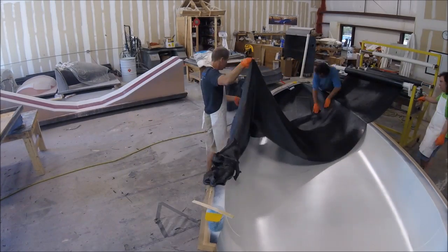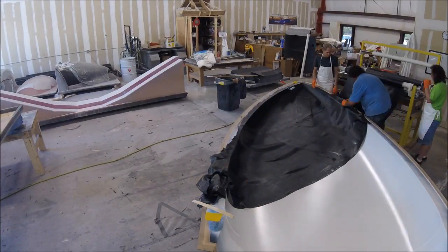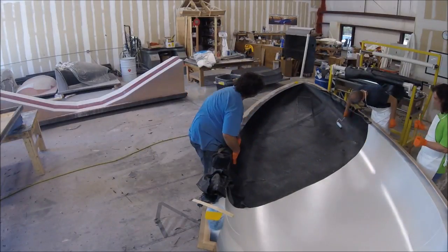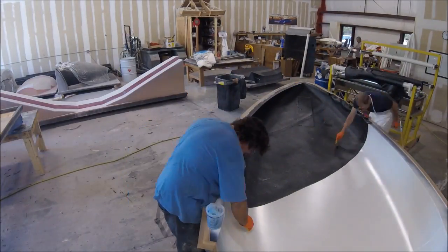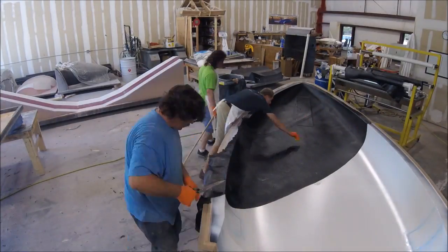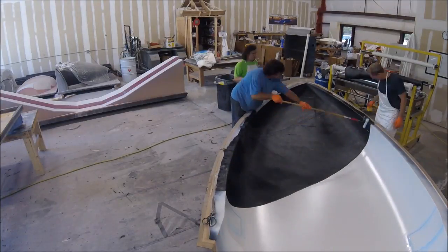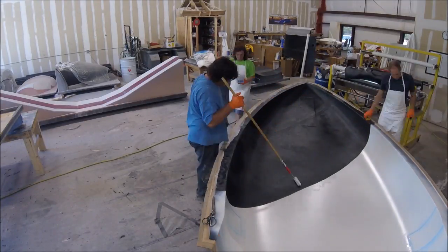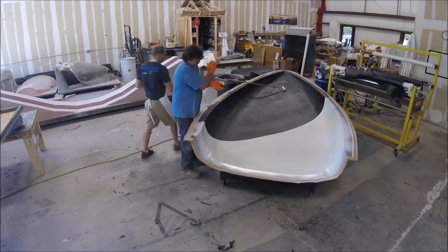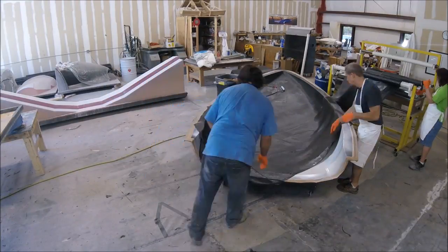Here's our update for the first part of this week. We started laying up the lower half of the fuselage, actually creating the part. We're using the heavy ply, which is equivalent to three plies of carbon fiber, laid across on an angle with a slight overlap. We're using the impregnator to wet down the fabric - it comes out squeezed through the rollers with pretty much the right amount of resin. This is the first time we've used it, so we're experimenting to see what settings are needed.